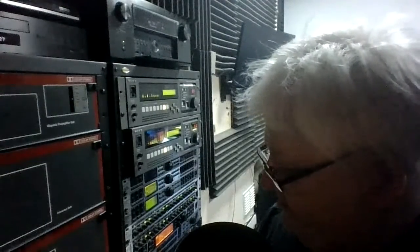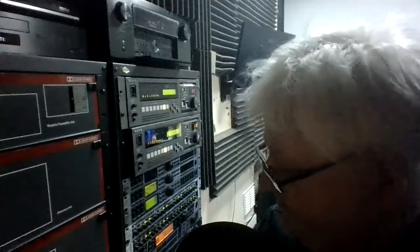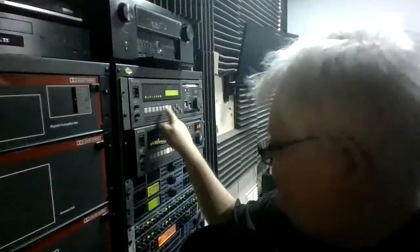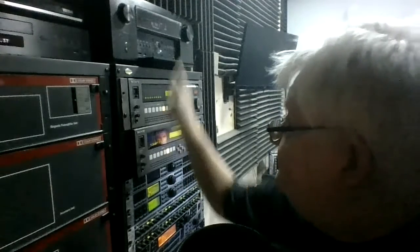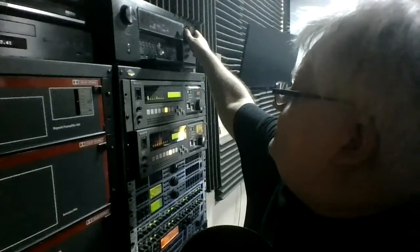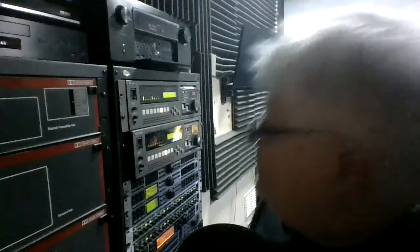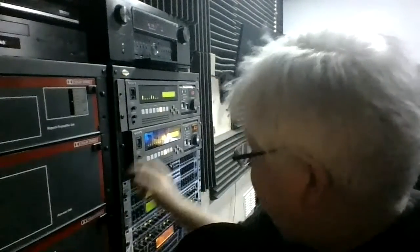I'll turn the Dolby CP200 fader down because the CP200 passes through auxiliary number 2. And that's going on the AVR. It's only going through stereo left and right at the moment because I don't use Dolby DSU.